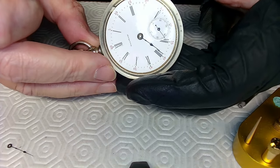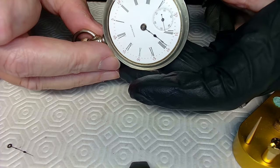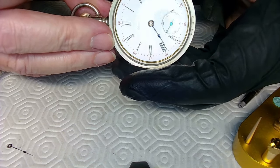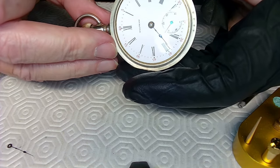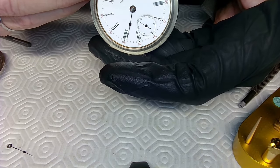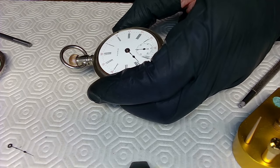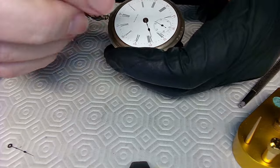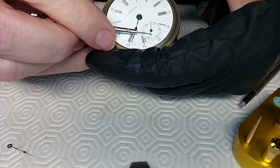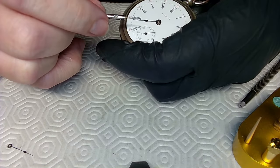That second hand can go down a little further — I'm careful not to press too hard on the fourth pivot wheel. That's about as low as it'll go; it's almost scraping. I'll let this go around and see if there are any issues. The rear of that hand is super low.